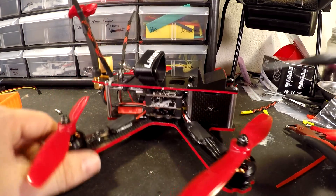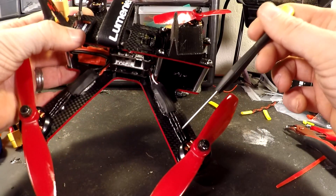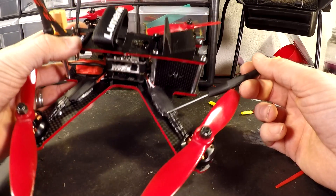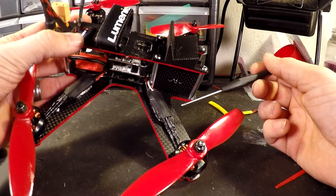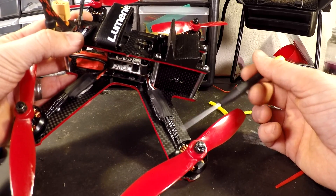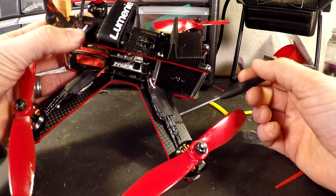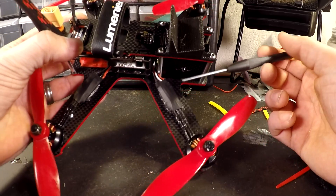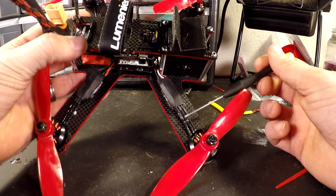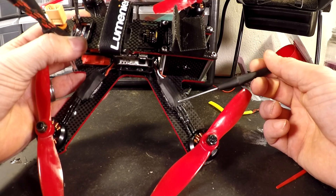We've got the Zeus — the MRM Zeus Little Bee 20 amp ESCs. For the motor wires, I did not cut them completely down. On this frame, doing that would have left really short wires for the motors — I've done it on other builds and it works, but anytime you want to change something it becomes a pain because you can't keep cutting those wires down. So on this one I took the motor wires, ran them over the top of the ESC and back around, and soldered them on the bottom side. Three of the ESCs have motor wires going over the top and around to the bottom, and one goes under the bottom and comes around the top — so if you have OCD, I'm sorry.